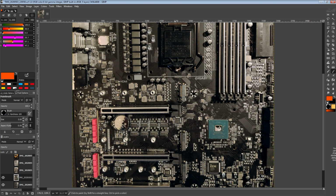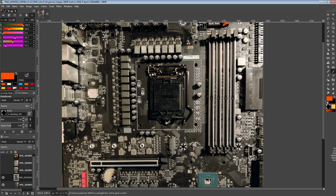So really the only thing in terms of overclocking features on this motherboard that I think is missing is a safe boot button, which is really annoying in my opinion. For a motherboard this expensive, you would want a safe boot button, especially since this is a Gigabyte motherboard, and Gigabyte BIOS along with Asus BIOS, and actually ASRock BIOS is pretty bad about it as well. I think MSI is the only motherboard vendor that consistently has motherboards that will just give up very, very quickly if you punch in bad settings.